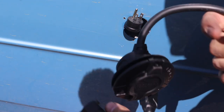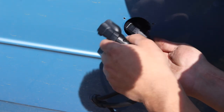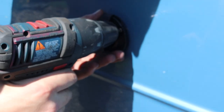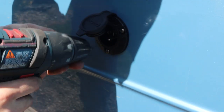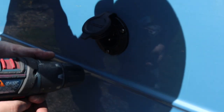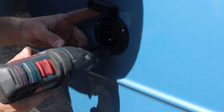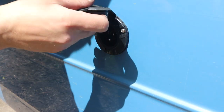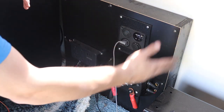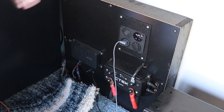Here's the new one that has two plugs. I'll go ahead and plug this one in right now. You want to snug these things up pretty well — you can see it's definitely squishing the weather seal in, but what you don't want is to over-tighten them and have it start pulling the metal through and essentially strip it out. So this is my power wall and the rest of this project is just going to be taking place in here. I just need to remove this face panel and pull it out, and then I'm going to mount the charger right here.